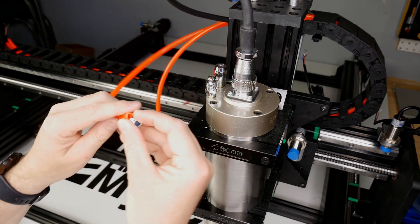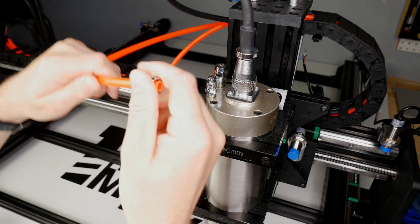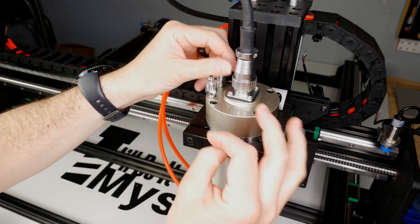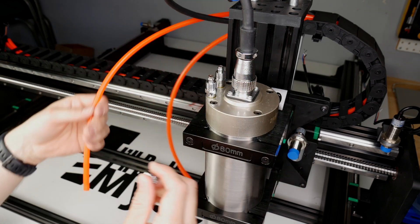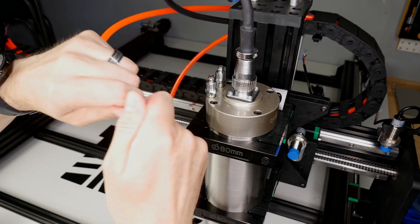As the spindle cables in the kit are pre-soldered, you can connect them straight to your spindle. Now go ahead and remove the retaining nuts from the spindle for the coolant lines and slide them onto the lines. Then firmly set the coolant lines on the spindle and tighten the nuts down to prevent any leaking.